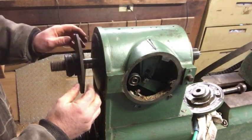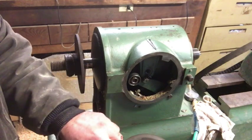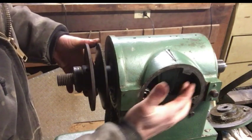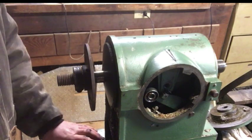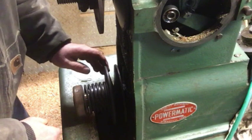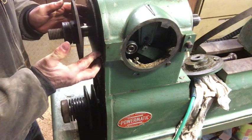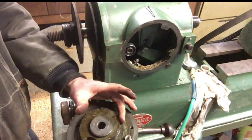What happens with this top portion on the headstock is when you rotate the hub or handle, it walks back and forth right here and physically pushes things back and forth along the headstock spindle. The spring-loaded tension runs back and forth — it's similar to a centrifugal clutch on some go-karts, where as the speed increases the clutch runs back and forth causing this to open and shut. But it's not the same — this is variated because this lobe right here varies in size.